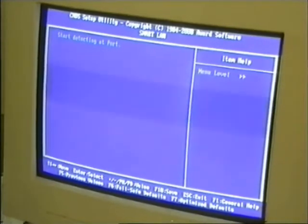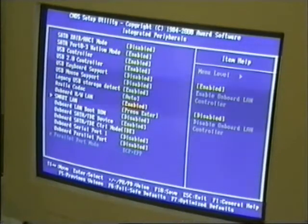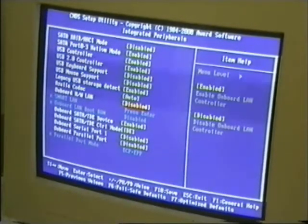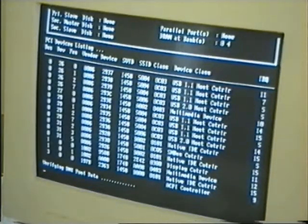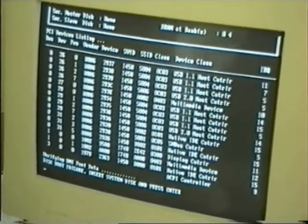So that's working. You'll find that won't work if your board's got this problem. So the best thing to do with the 1.8 volts in is set the onboard LAN to disabled. We'll save that. Then when you remove the 1.8 volts you can start the board up normally — you don't really need that rail as long as it's been left disabled. Everything should be fine. There you go — now you can see it's not restarting and it's not trying to initiate the LAN controller. Good luck with that.